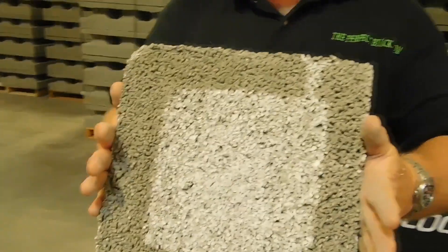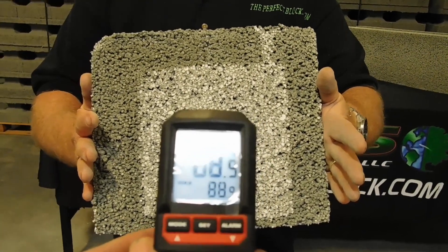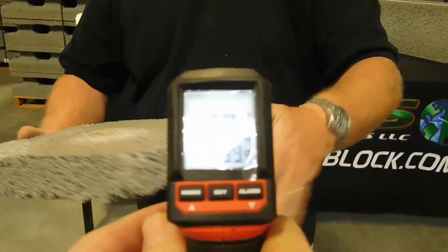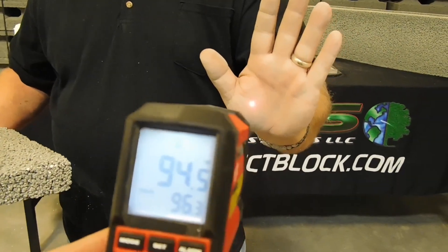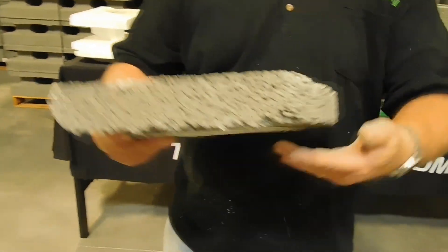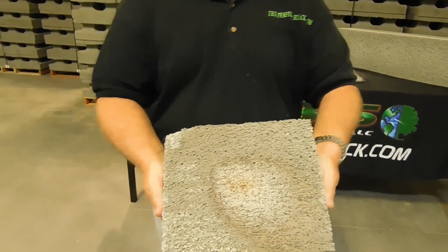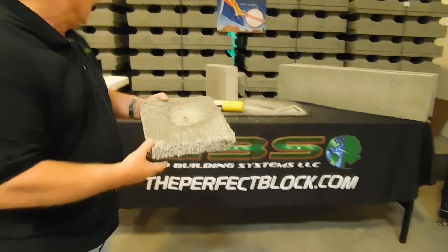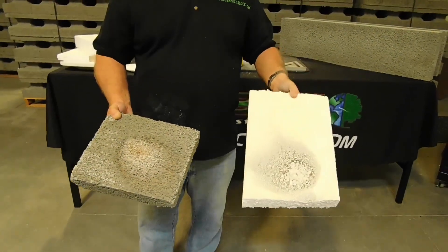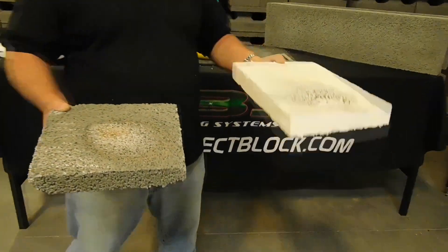This is map gas, not propane, burning at about 3,700 degrees Fahrenheit. We're over two minutes. I'll take the flame away. Shoot that right where my hand was — we've got 89 degrees. It was 82 before. Shoot the hand — 93, 94. Yeah, it's probably the heat of my hand heating up the side, not that big glowing patch of red that was there for two minutes. So, a little big contrast between expanded polystyrene and expanded polystyrene mixed with cement. That's the Perfect Block.